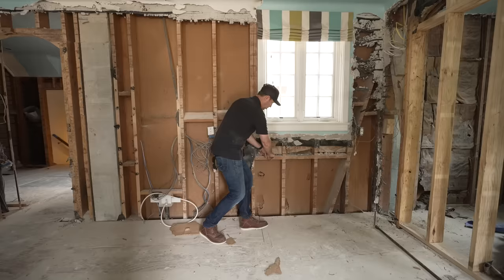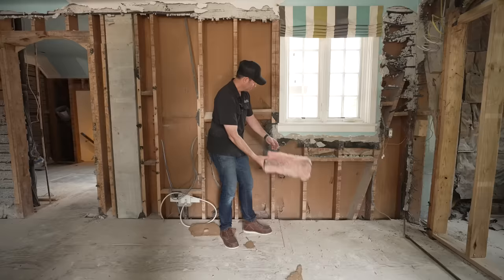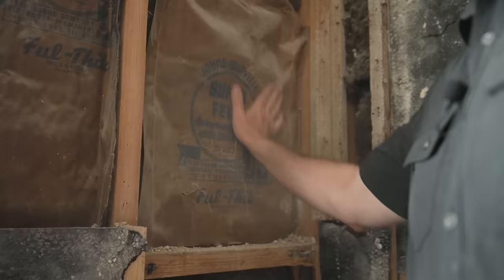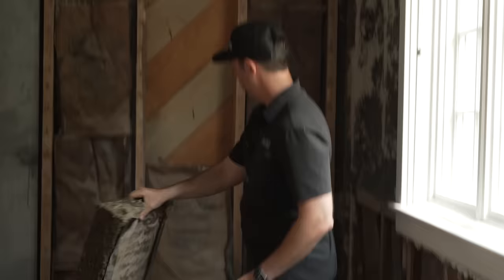What's interesting is this wall cavity has had some renovation over time. This cavity — let's say 1928 — about 15 to 20 years ago got renovated, the window got smaller. This is the original sill, and when they renovated they put some pink insulation in there, then re-plastered that area to match, and also put some tar paper on the inside. One bay over, this was probably done in the 1940s and has some original rock wool — mineral wool-based insulation.